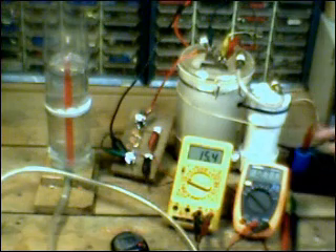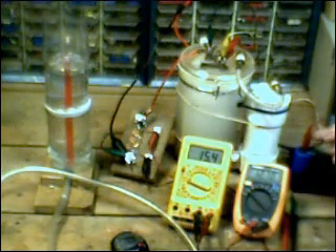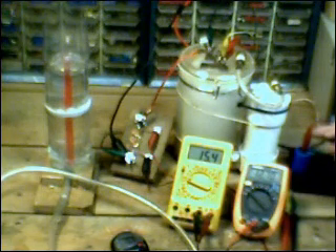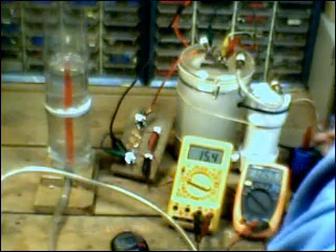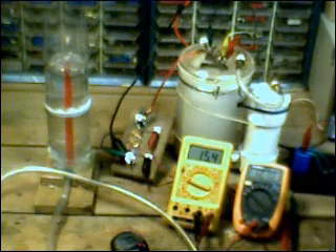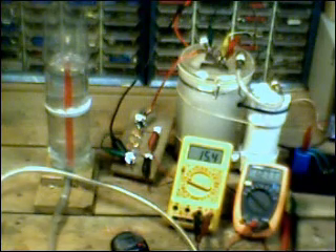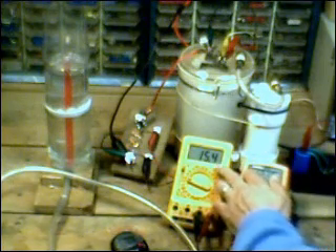I had to make a repair to one of the clip leads that I thought had been soldered. When you buy these clip leads at a hobby shop or Radio Shack or wherever you get them, pull all the hoods back and touch them up with solder. All they are is crimped on and they have a tendency when you put current through them to make a very bad connection and cause you much more grief than they're worth. So spend a little time, put some solder on there, make them nice and snug.